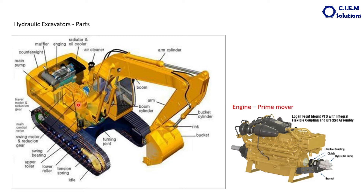The superstructure has the prime mover — here it is the engine — then coupled to the hydraulic pump, the main pump here. Then this is the counterweight to balance the complete superstructure when it is fully loaded. Then the engine components like muffler, radiator, cooler, and air cleaner. Then after the pump, this is the control valve.